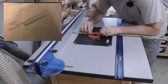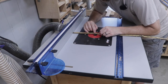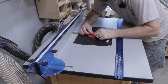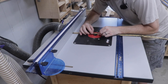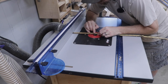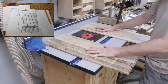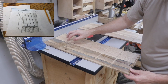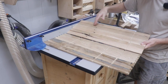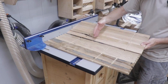I'm cutting a dado in the lower portion of the frame that will hold one of the dividers that attaches to the shelf, and it's going to be at six and three sixteenths. Actually, I told you wrong — this is the bottom piece of the cabinet and this is the shelf. I've already cut the dado on the bottom of the cabinet, and now what I'm doing is cutting the matching dado on the shelf, so each place I have a dado here I'm going to make it in the same position on the shelf.